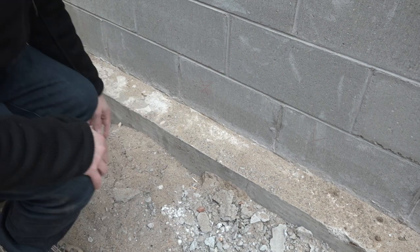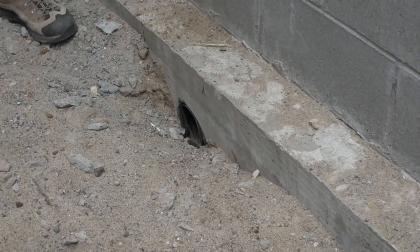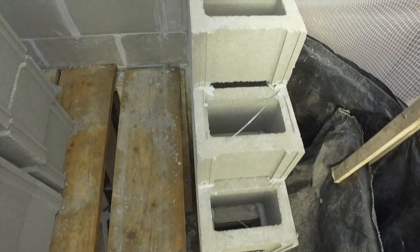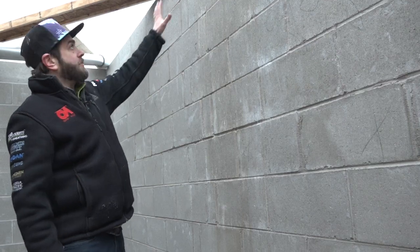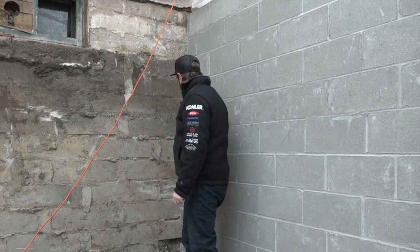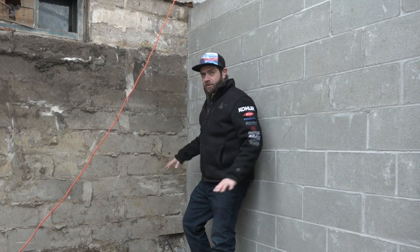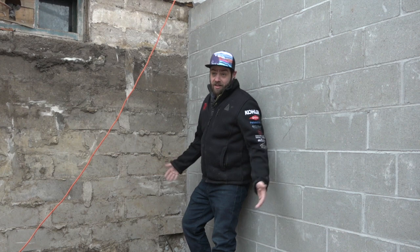This is our footing — 10 inches thick and two feet wide. The drain tile is on the outside of the structure. The CMU wall has wire reinforcement every other course, then rebar every four feet with core filling, and a bonding beam at the top that ties the whole thing together — solid filled. At the original foundation, we drill into the old block work and pin the new foundation to that one, which helps eliminate any difference in movement. Sandy soil of this quality means we won't see a lot of movement, so things should be pretty stable.